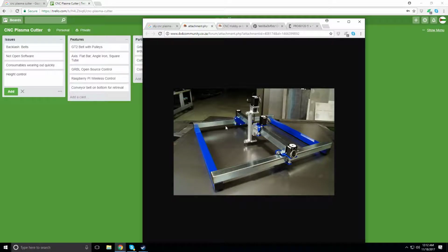So maybe get a piece of A36 bar, the same exact A36 bar I use here, that goes all the way down the slats, and then cut some slots in there, and then try to find the largest blade that I could use to cut the slots in, or figure out how I'm going to do that. Maybe have somebody cut it on the water jet so that the slats fit in there. Probably have somebody cut it on the water jet, because otherwise I would need a cold saw blade, and I don't really have access to one right now. And a fat cold saw blade, so those slats could be at least 1/8 inch, because I don't want them to bow too much in the middle, even though they're going to be lengthwise. So lengthwise they're not going to bend too much.